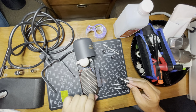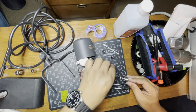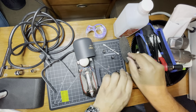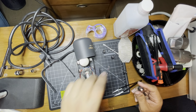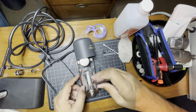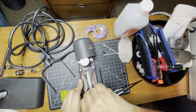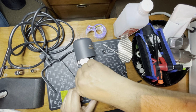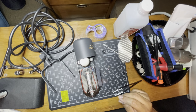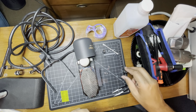It's like when you walk out of your house and you go back to check if you locked the door. Let's take this off and go back in reverse to double-check our ribbons. I can put a little bit of extra juice on these — yeah, that one's good, that one's good. That's pretty good. You're really holding down gold leaves, so it's not like you need to crank these. I'd be worried about stripping these small screws. Hand torque is fine — it's not like a seatbelt in a car. That foil is resilient enough to be tightened down by hand.